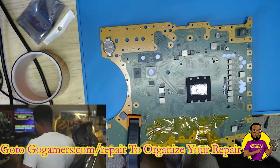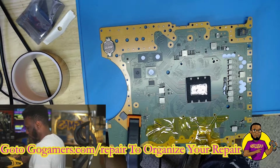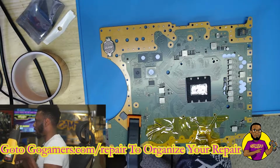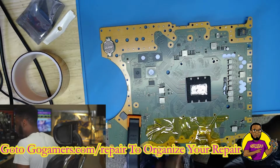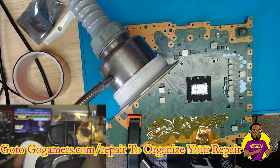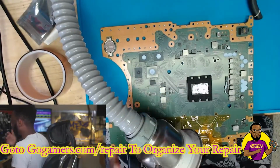I'm going to come in with my heat gun. Now the type of heat gun that I use is this Wagner heat gun right here. I'm going to turn this on. I'm going to turn it to the second highest setting. I'm going to turn the fan on high. You guys can see my settings are kind of blurry, but you can kind of see it. And we're going to apply the heat from underneath, right? So let's get started on that. We're going to go over to our microscope, and we're going to get ready to get this desoldered, and also we're going to turn on our fume extraction.